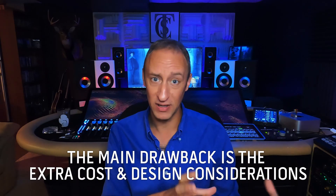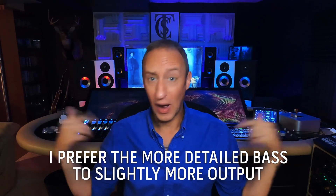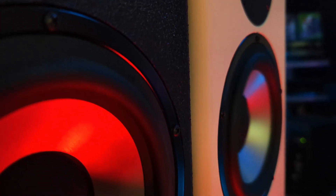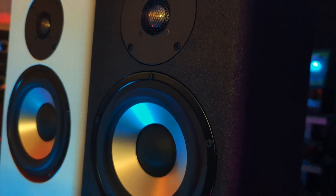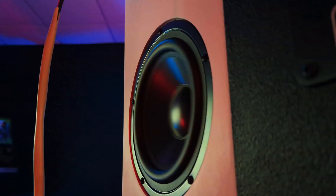There are still drawbacks to a passive radiator — they're often more expensive and take up more real estate in the cabinet. But to me, the trade-off of more accurate and better detailed bass is a higher selling point than just having the port. I built both of these pairs of speakers by hand. The black pair is the ported design; the white pair has the passive radiator. Everything else is identical: same cabinet types, same crossovers, same crossover parts — good air core inductors, German polycaps, and German metal oxide resistors. The only difference is that one is ported and the other has a passive radiator.